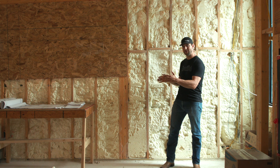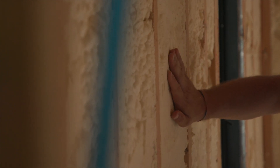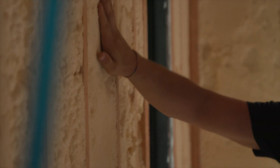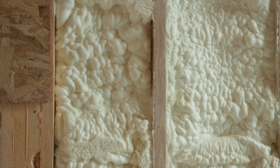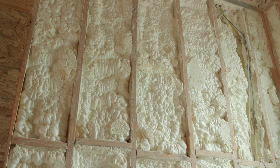If you went all the way to full cavity thickness and then shaved it, even though you're wasting time, labor, and material on the floor, it's easy to check that it's all uniform thickness. In this house, I've seen several places where it's actually underfilled — where there's not enough insulation — and we're going to have to come in and bring that back to full thickness.